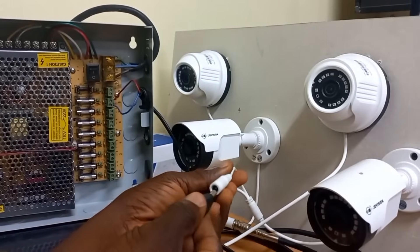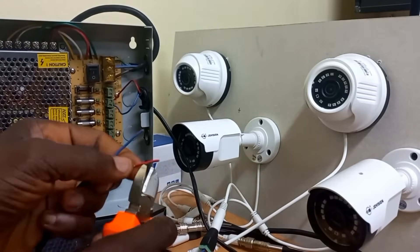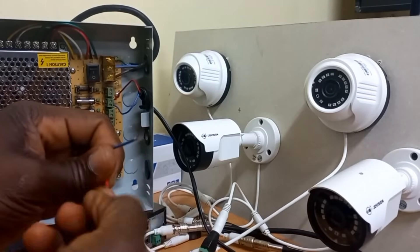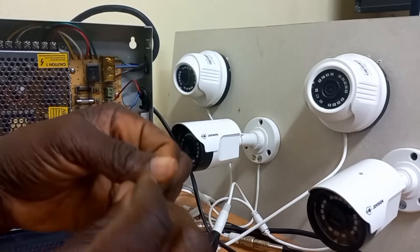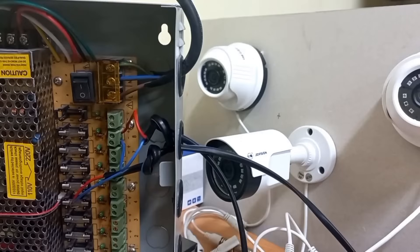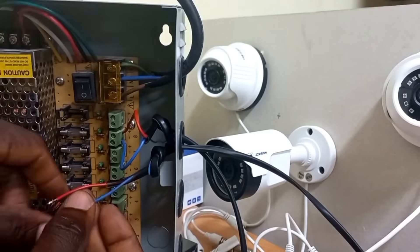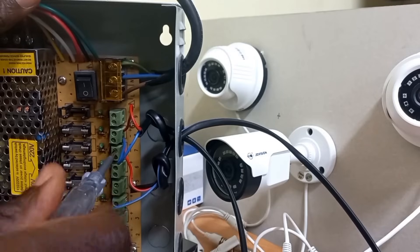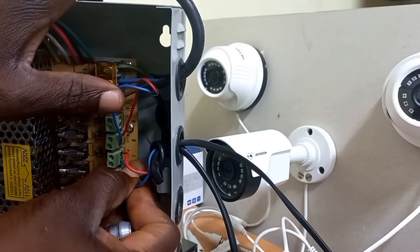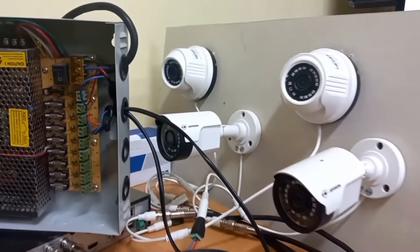I will go through the same wiring process for the rest of the three cameras. I will plug this power cable into this camera. I will have to strip this end to expose the conductors — with the help of my pliers I will strip off the insulation, place the conductors together well, and get it trimmed. I will loosen the terminal blocks, insert the wires, and tighten them. I will repeat the process for cameras three and four.